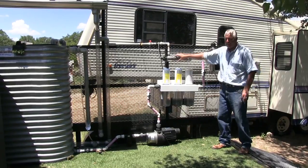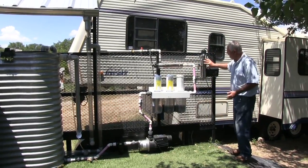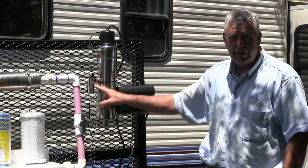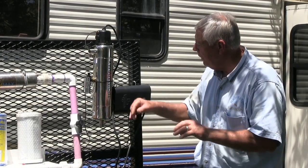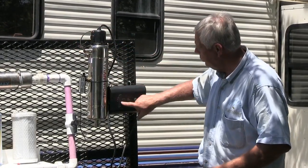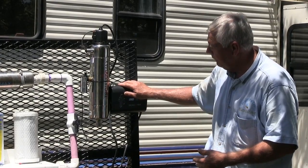This one here is a Class B UV light, which is not suitable for fully disinfecting water — it's more for polishing water. Whereas this one right here is a Class A. They may both have the same intensity of light, but the Class A has a control on it that monitors the clarity or turbidity of the water. If it gets too cloudy so the light cannot shine through and destroy pathogens, it will shut that water off. This control tells me not only how many days it's been used, but also when that water is not going to be acceptable to use.